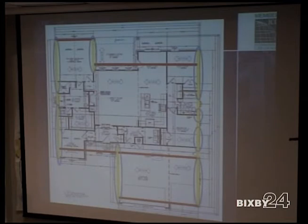If you have a question? For the side-to-side bracing, with the same equation, same analysis, if I take the CS-PF panel out and I have enough wall on the other wall, can I just stick with the same calculation, not redo the calculation with the new wall brace line, skip that one and just stick with the minimum amount I have? Right, the covered patio walls. So just leave it the way it is, without going through the CSPF? You cannot, because you don't meet the three requirements.